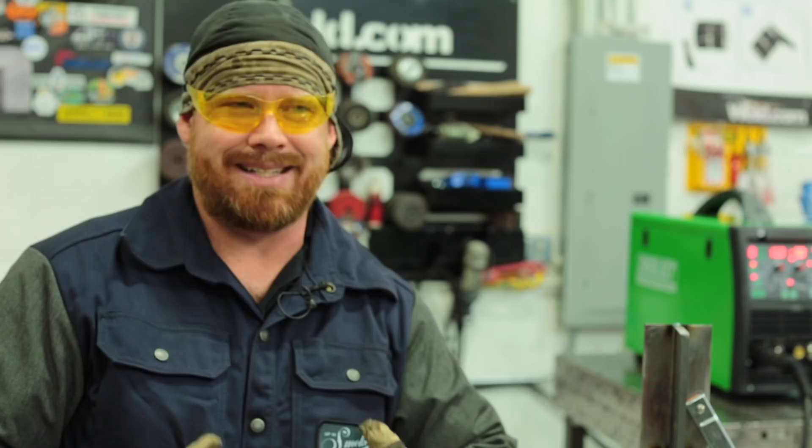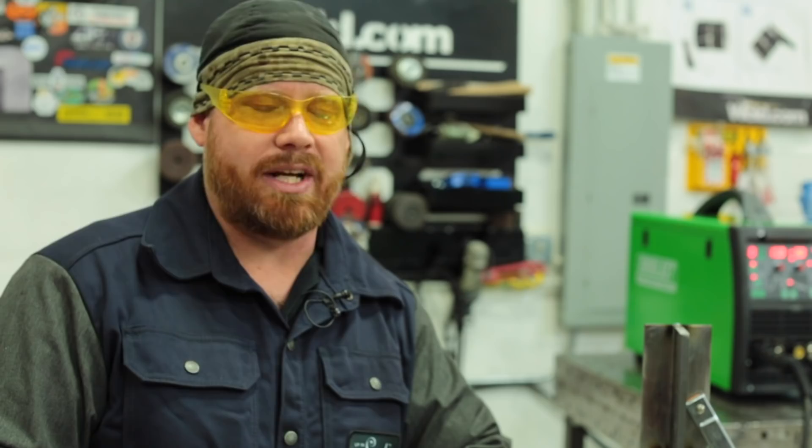That's one of the reasons it's not considered pre-qualified by D1.1. So what do we do when we have to weld thicker material and still want to use a 70S6 wire? One thing we can do is get into a spray transfer, meaning we change the gas composition to 82% argon or higher, with the balance being CO2. That puts us into a true spray transfer.